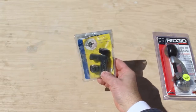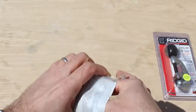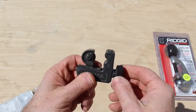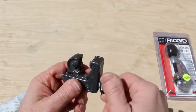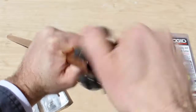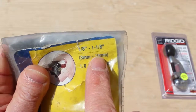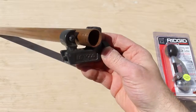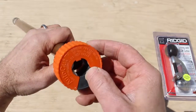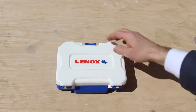The second kind of tool is this Brass Craft large diameter mini tube cutter, and what makes it so cool is it's adjustable. Unlike the AutoCut tool, which only cuts ½-inch—and you have to buy a new AutoCut tool if you want to cut 1-inch or ¾-inch copper pipe—you can adjust this Brass Craft mini tube cutter. The only problem is it takes a little bit longer. It cuts 1/8 up to 1-1/8-inch copper pipe. Here's a 3/8-inch copper pipe—you can cut that, no problem.